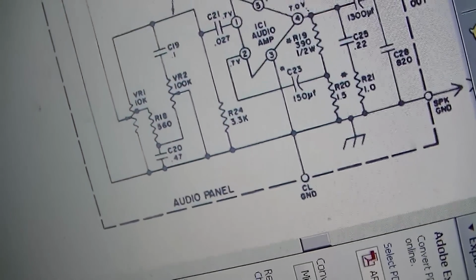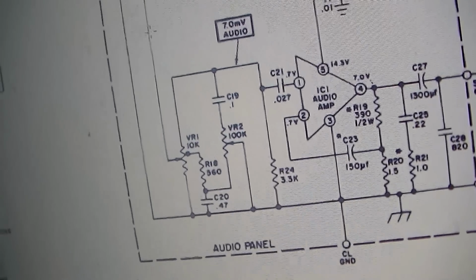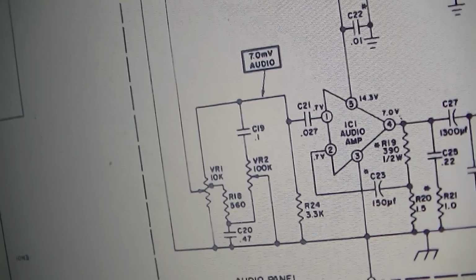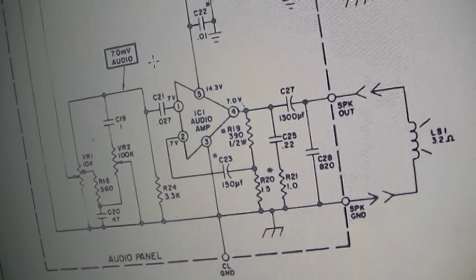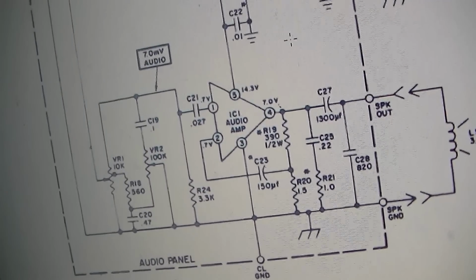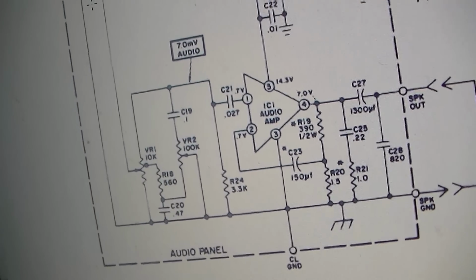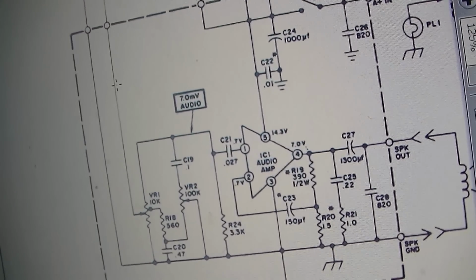One reversible modification I might do to this radio, which I think would be pretty useful, would be to add into this line right here, the line that goes into the volume control, a switching female audio jack, so that I can plug my phone or MP3 player or whatever into this thing and use this as a stereo. I'll probably put another stereo in the car, but it would be neat to have a little audio plug hidden somewhere, so that I can just plug my phone into this if I need it.